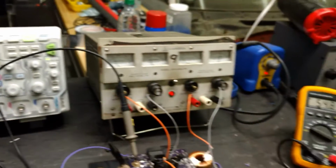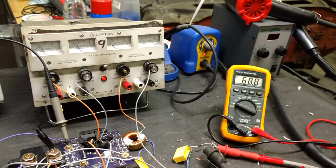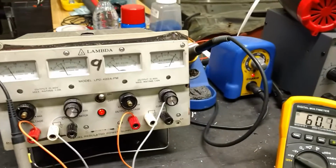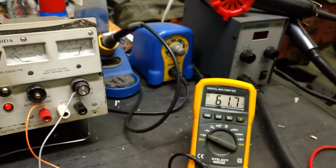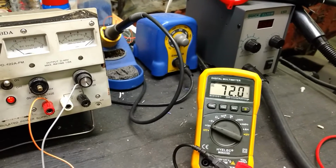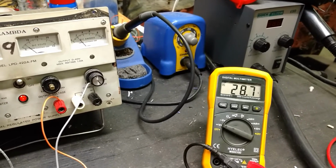I think what happens, I'm going to go out on a limb here, but once we go full on, we're going to drop voltage just like that. And you can see it actually basically just pegs the current on the output, because once it gets, we'll just keep watching that, you get to that sweet spot there where it climbs and it becomes no longer efficient and it drops off. Gotta turn the duty cycle down and it comes back up.